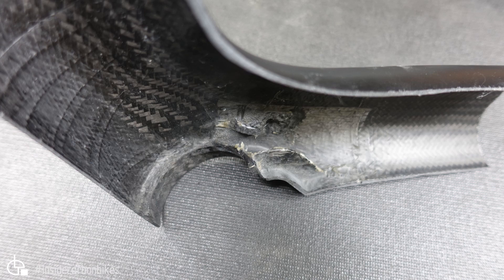Here's another view of that area. You can see the rib again through here — a nice consistent join around that headset. There's a little bit of what you'd call a dag through here. There is a cable port there, which would be allowed for in the mandrel, giving you a little bit of excess resin there, but that's no real issue. That area is all pretty good.